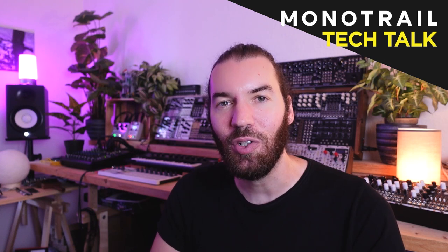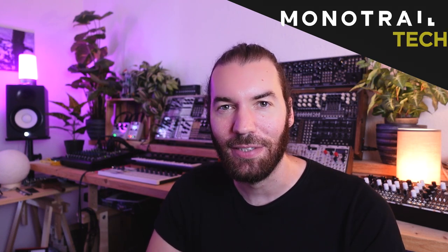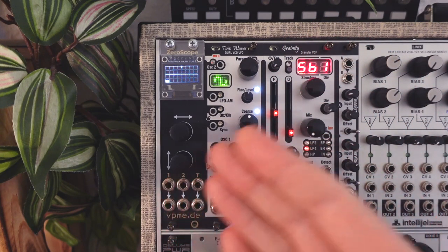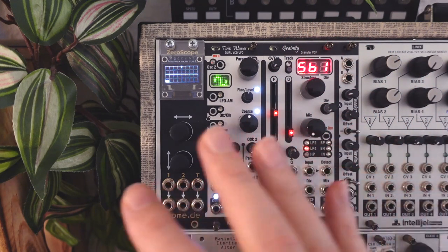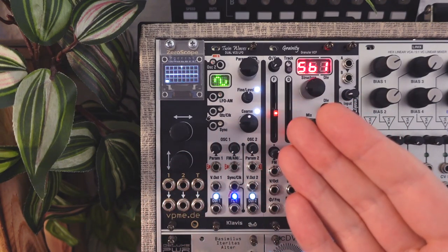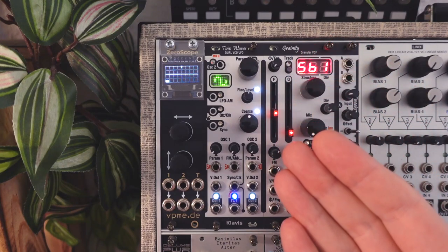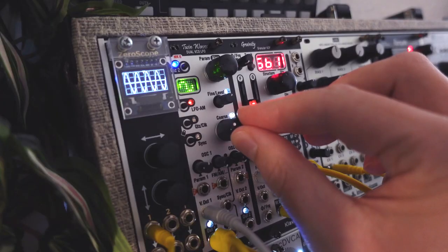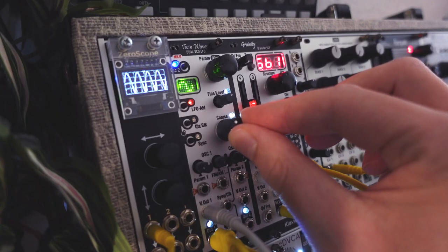Hi, and welcome back. If you care about sound and making music, old sayings and nostalgia should be something of the past. There's no doubt digital oscillators can be powerful and have strong advantages over their analog counterparts. I recently added the Klavis Twin Waves Mark II to my setup, and it's a perfect example. It's a compact, very price competitive module that has two independent oscillators. Either of them can function as VCO or LFO, and each mode has a series of useful algorithms to choose from. The VCO mode can do classic analog wave shapes with shape modulation,